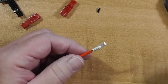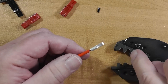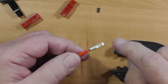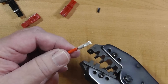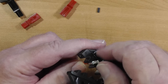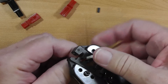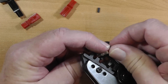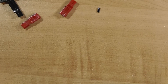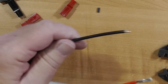That's about right. Now we need the crimp tool, and we want the one that says 30 amps, which is this hole right here. We're going to crimp down on the surface that's split. We want this thing pointed down just slightly, and we're going to put it in there. Keep it like that. This takes about six hands. And then you crimp the little daylight out of it. The instructions say to give it a manly squeeze, but I think any woman is capable of doing that.